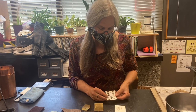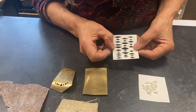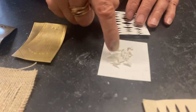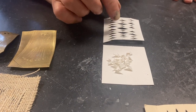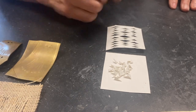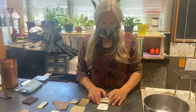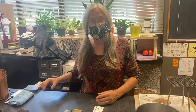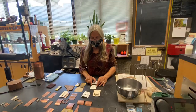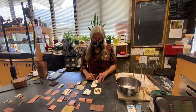I do want everybody to have a chance to make some samples and figure out what they're doing. I'm going to try to roll print this — I was thinking about rugs and Navajo patterns when I was thinking about this design. When I cut this out I got left with all these little extra particles, and I'm thinking it might be fun not only to roll print this for the negative spaces, but what would it look like if I took all the scrap and put my metal back through the rolling mill? Could I get a more random, confetti-like pattern? My professor Gary Griffin in grad school always said sometimes the idea you think about isn't as interesting as the opposite idea — so I gathered these up thinking I should try roll printing the bits and pieces. I might find out it doesn't work well, or I might find I like it better than the more organized patterns.